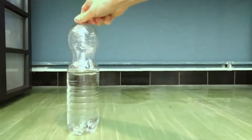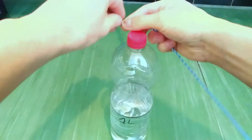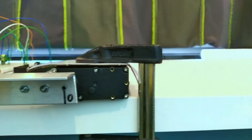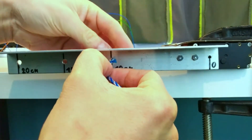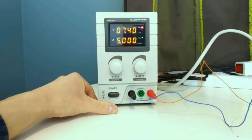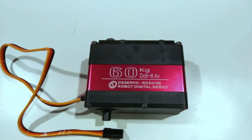For the test I prepared two bottles of water that weigh one and two kilograms. I tied some string to the neck of the bottle and made an aluminium servo extension that attaches to the driveshaft piece. This allows me to attach the water weights at different distances from the center to get different torques. I set my power supply at 7.4 volts, which is the recommended voltage, although they are rated from 6 volts up to 8.4 volts.